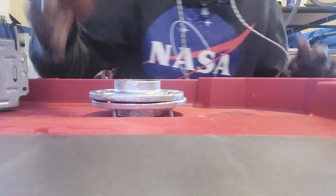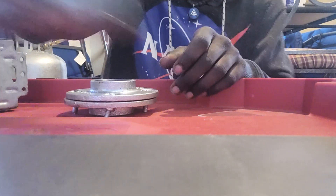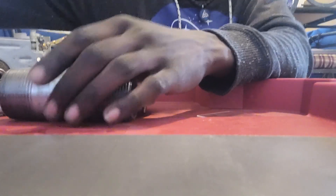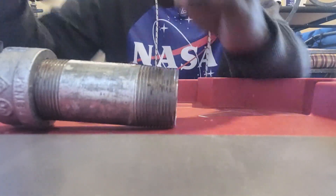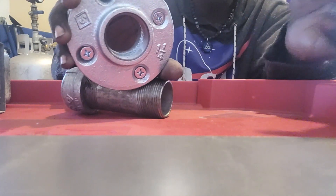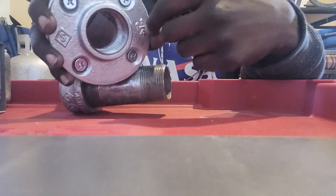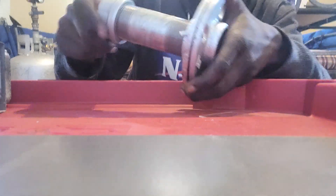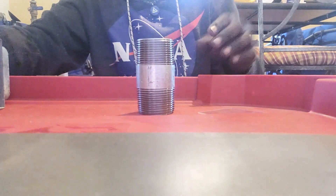So here's the idea. We have these right here — floor flanges, inch-and-a-quarter floor flanges. I put two together. The idea is we're going to have a pipe like this; this will be the pipe the magnetron goes in, and it's going to have a cap on the end so the microwaves go the direction we want them to go. This is going to screw into the floor flange. I have a piece of quartz glass in there — you can see the quartz glass in there, can't put my finger through, you can hear it. We're going to have that siliconed up with RTV silicone to make a nice airtight seal that can screw in there. And this will be welded onto the reactor.